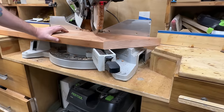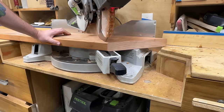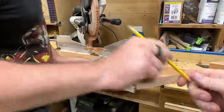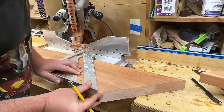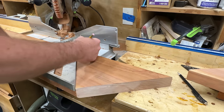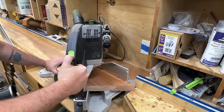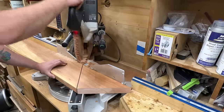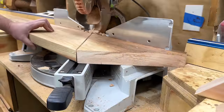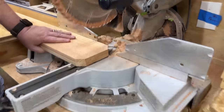With all the 2x4s cut, it's time to cut the triangles that go on the ends of the planter boxes to retain the dirt. I chose redwood for mine because we're putting herbs in there — food that's consumed — so I'd rather not use pressure treated. You could use cedar or even pickets. Use pressure treated only if you're doing flowers, not food. This is the 2x8 I mentioned; the whole planter is designed so that a 2x8 — actually about seven and a half inches wide — fits perfectly in the ends of the planter box. And you only need about half of an eight-footer, so you can get two planters out of one board.